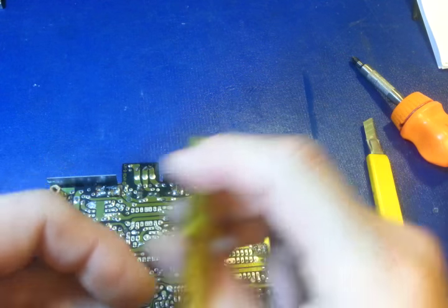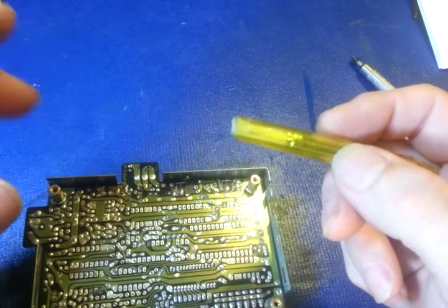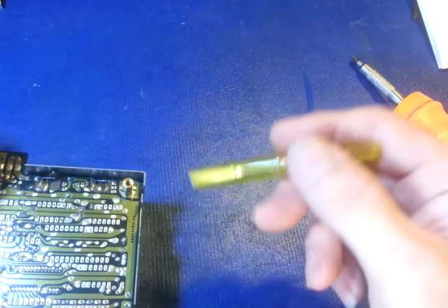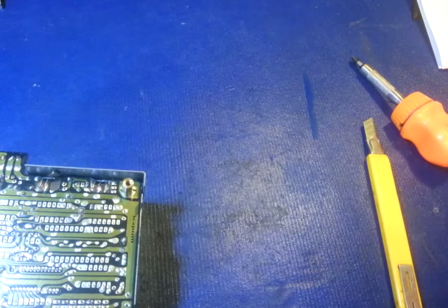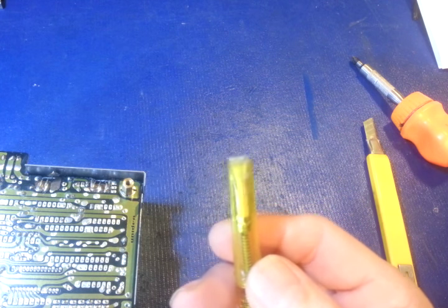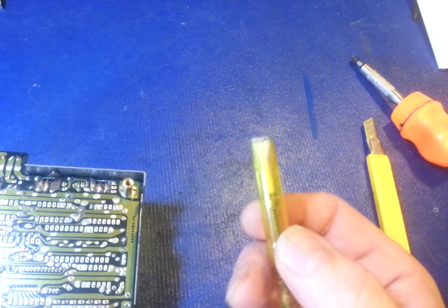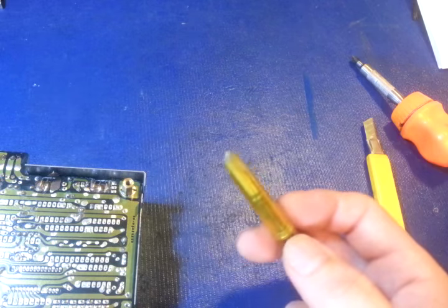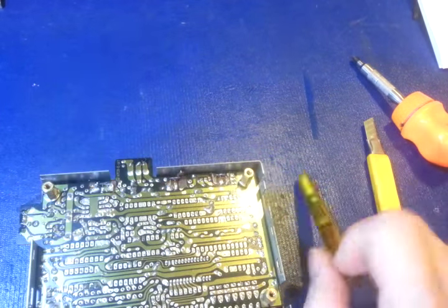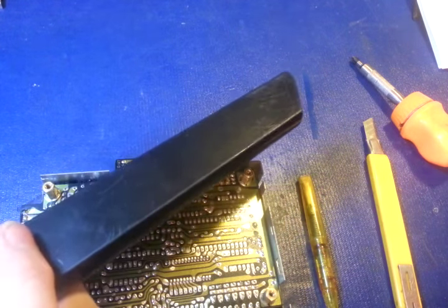I've got skin like cowhide, but you can hear that. They're very hard. Well, when you're cleaning up stuff, those bristles will break off little pieces of them. And I can't count how many times over the years that those little bristles get on your bench top, and then you set your hand down, or you set your elbow in it, and you've just jammed an almost microscopically small glass needle into yourself, and trying to get that out without it breaking off. So I've learned that anytime I use these fiberglass brushes, as soon as I get done cleaning, vacuum cleaner.